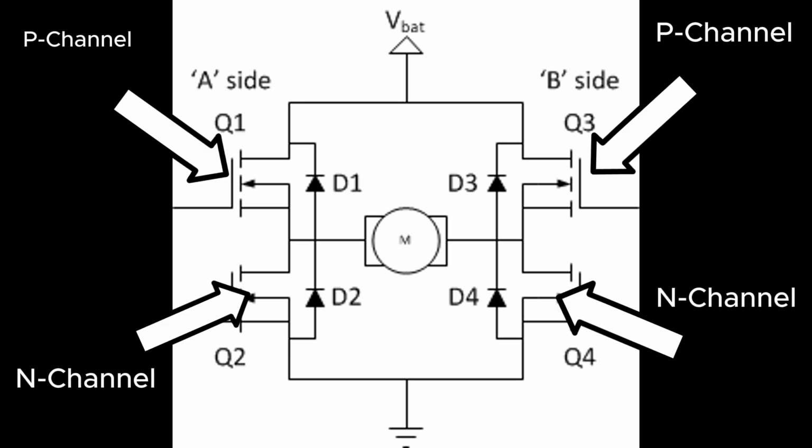It provides the data for all the N-channel MOSFETs and P-channel MOSFETs, and it does this through 3 595 shift registers, which are tied together in series. The data goes directly into the N-channel MOSFETs. If its output is 1, it's enabled. If its output is 0, it's disabled.